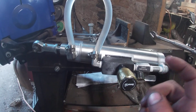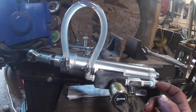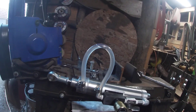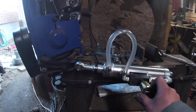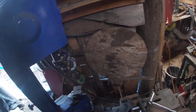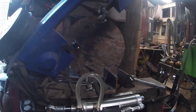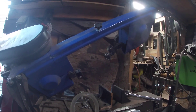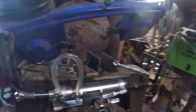For feed control, you can use a standard needle valve, but it's more of a pain because while you can control the down feed, you have to open it all the way to lift back up. What you want is a free flow valve. Let me open it and demonstrate — you can lower it slowly, open it to speed up, or close it to slow down or stop. The key advantage over a needle valve is you can close it all the way and still open it freely to raise the head.